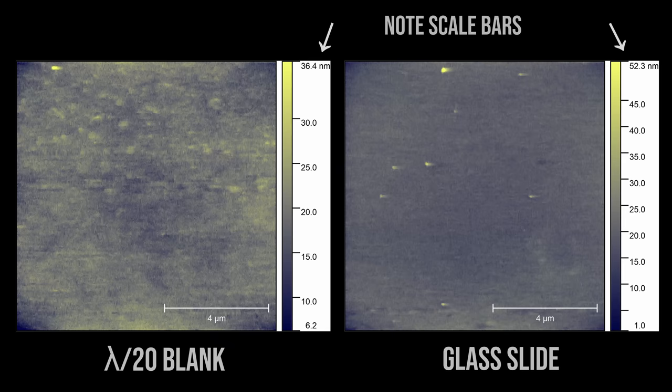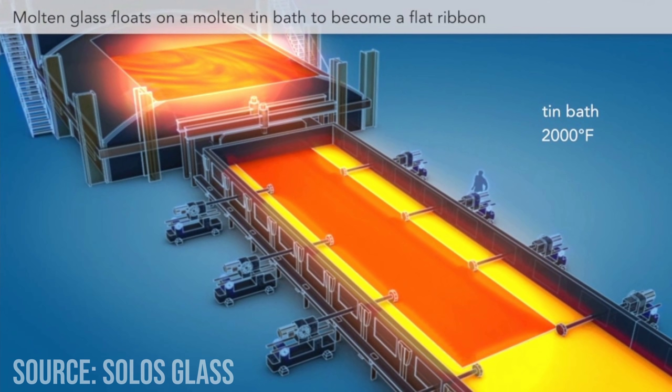I think these are actual particles on the glass surface, so the deviation is quite a bit higher here than on the precision optics, but the average roughness just barely beats it out — it's a little bit smoother. My theory is that this is just a cheap piece of float glass, where the glass is floated on a liquid metal surface while it's cooling, and that gives you a remarkably flat surface because it's just relying on gravity to flatten everything out. But you don't have a whole lot of control over the peaks and valleys, so the optical properties are not quite as good as something that's been precision ground.